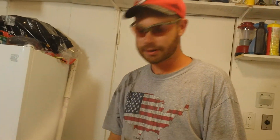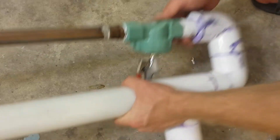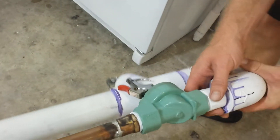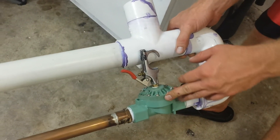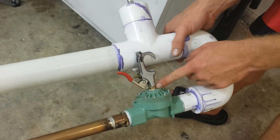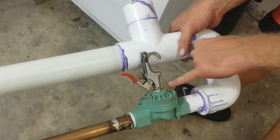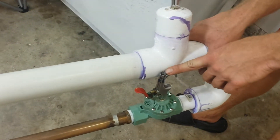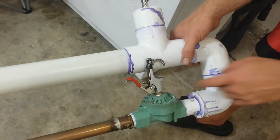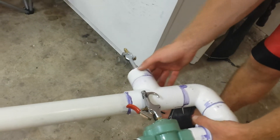It's longer, it's copper, it closely matches the ammo — I'll show you why in a second. The valve is an Orbitz one-inch irrigation or sprinkler valve — a jar top is the more technical term. Got a blow gun valve; I drilled a hole with a tap and die set, ran a fitting in there. Don't forget the Teflon tape or it'll leak. I took the little tip out to help it flow a little better. It's a simple build.